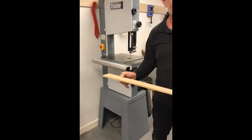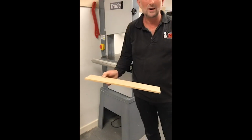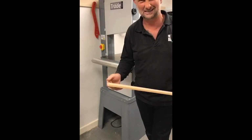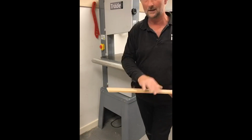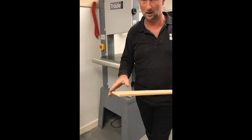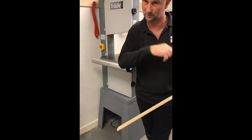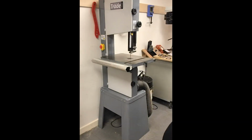I know I'm only making 2 sides to my cabinet, but I might be making 20 sides to a cabinet. I've got a batch of 10 that I've managed to sell maybe to somewhere, and I want to repeat. You've got this template. You can go back to this each and every time and do an identical cut, as said, on a router table with a jig and a cutter, which we'll get to. So first off, I'm going to cut my template nice and precisely.